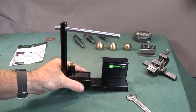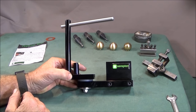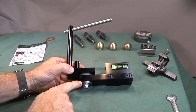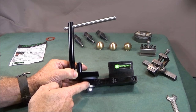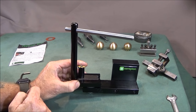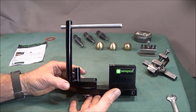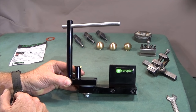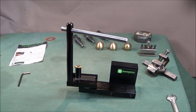There are reviews online — you can read reviews on Amazon on this tool and various other places — and there are people that criticize this bearing arrangement, saying it's not good because there's a tapered roller bearing in the top and not one in the lower half, it just has the ordinary ball race there. But I found that this arrangement is perfectly adequate; the tool runs lovely and smooth. Any problems you get with it are only from swarf or dirt getting into that top bearing. It's a shame because people buy a tool like this, don't know how the principles of ball turning work, have a quick go and don't get on with it, then give it a bad write-up and put people off buying what is a really fabulous tool.